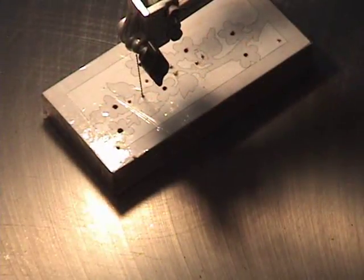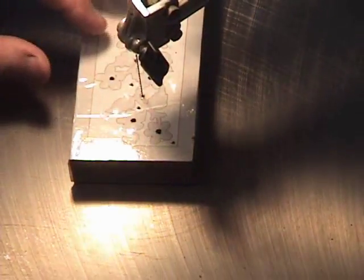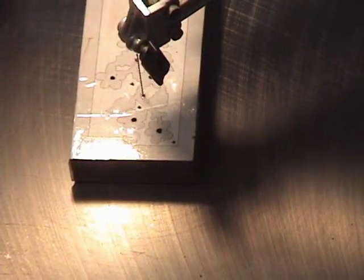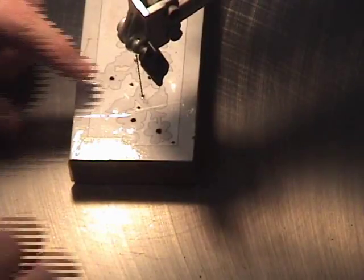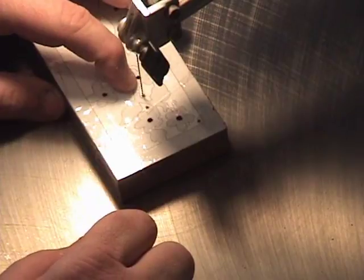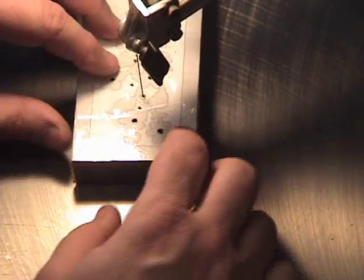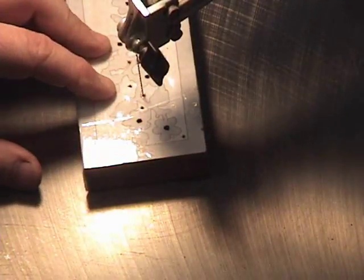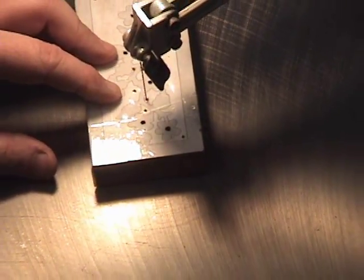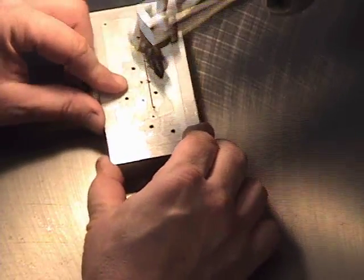On a piece like this, on the interior cut, again, this doesn't have to be cut perfect, but I've talked about this before. When you get ready to make a cut like this, try to find yourself a little corner you can start in. Try not to start on the curve of the pattern because you'll have a hard time hiding your transition from where you start and stop. So once you get to a place where you feel comfortable to start, try to start in a corner where you can hide that transition a little bit.